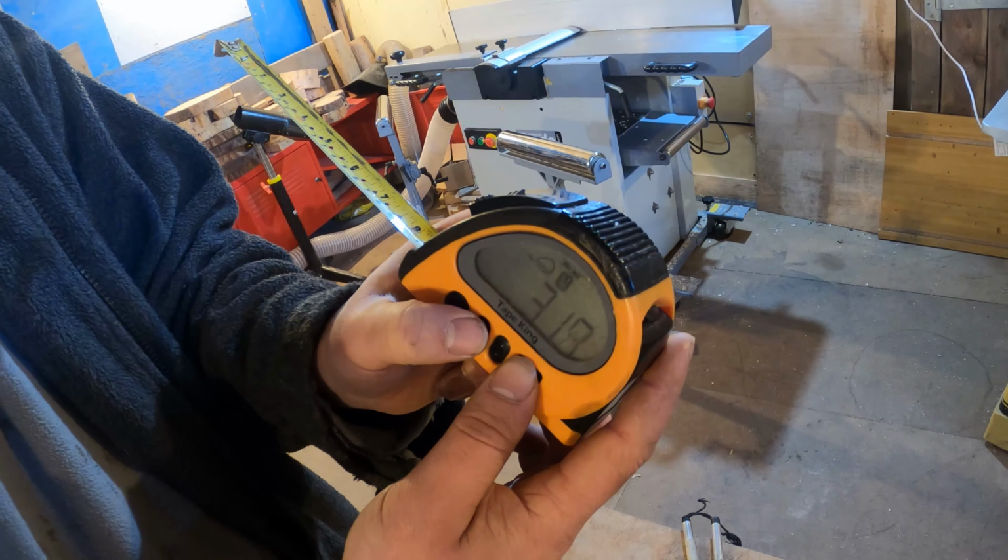The spirit level calibration is if you think the spirit level's off, so you find somewhere that is level, and then you put it on and activate it. Haven't done it thus far. It seemed pretty accurate. My biggest problem is finding places that I know are square in my house, because I have a 1920s house where things weren't very level, and my workshop's not exactly level either. But for most people, it should be fine. Just put it in the doorway or something and then do it, because you can rest it on the square side there or the bottom side there.